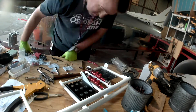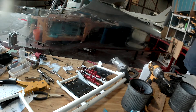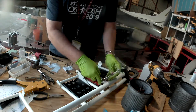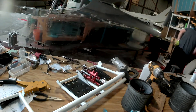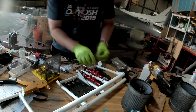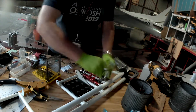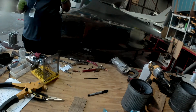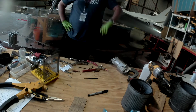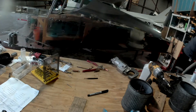It is a pain. These springs are wider than the stock Van's master cylinders — the stock Van's cylinders don't even have springs, it's just a shock. This is a shock with springs, so those springs are pretty wide. Whatever they tell you to use as washer spacers on the bottom, you might need an extra one, which is fine. Don't forget: according to the FAA you're allowed to have three washers back to back to back — after that you need a spacer.